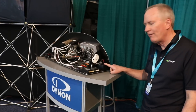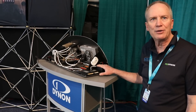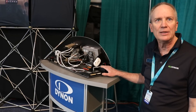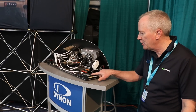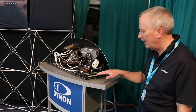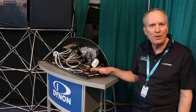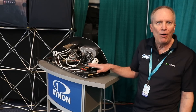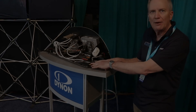Here we have a backup battery that will keep your system running for an hour, even with an electrical alternator fault, for example. Your avionics will keep going for an hour. And then this is your engine monitoring system, which connects to all of the temperature probes, oil pressure, and such — all the sensors for the engine all feed into here.